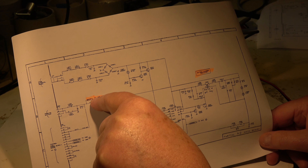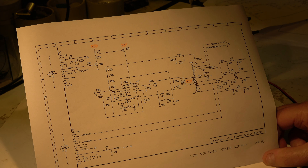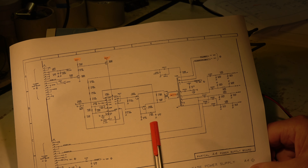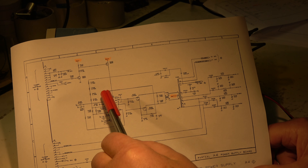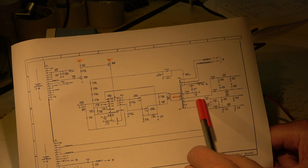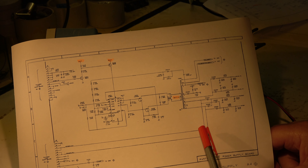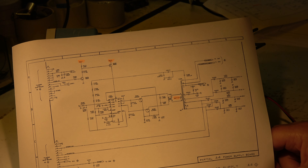The battery connection goes to the next stage, where we have the input from the battery or the external supply, which is also the battery connection here. Here's a second switching power supply which operates with two transistors in push-pull configuration and supplies all voltages for the scope: 6.7 volts, 5 volts, something for the filament heater, and an AC output — I assume for the cathode. Next step is to check whether this part is working, since these input voltages are available. I have to open it and we will see.